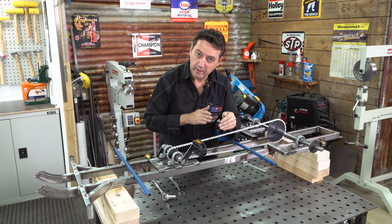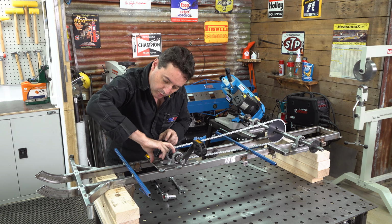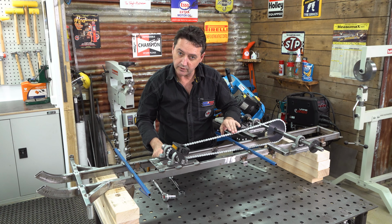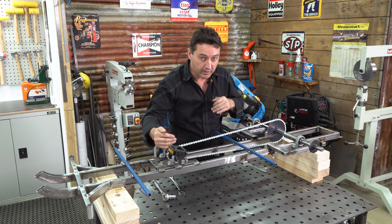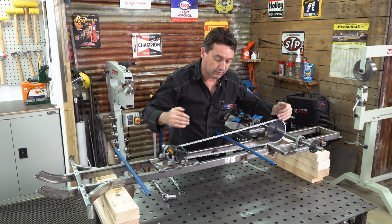We've done our joiner pin. Everything's correct as far as our chain now. We've also pulled our crank forward, nipped up 2 of the bolts, so we've got correct tension on our chain. Everything's functioning correctly. The final thing is we need to get correct alignment with our front and rear sprockets.